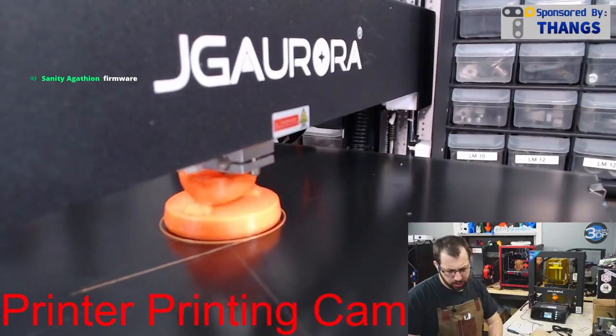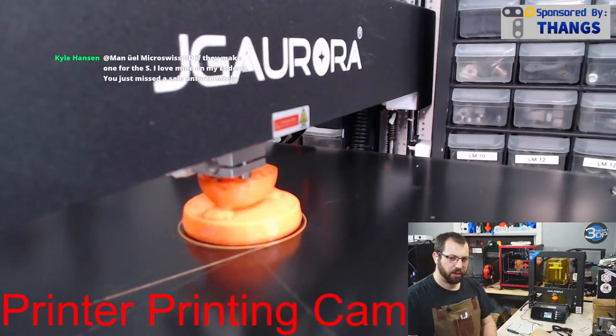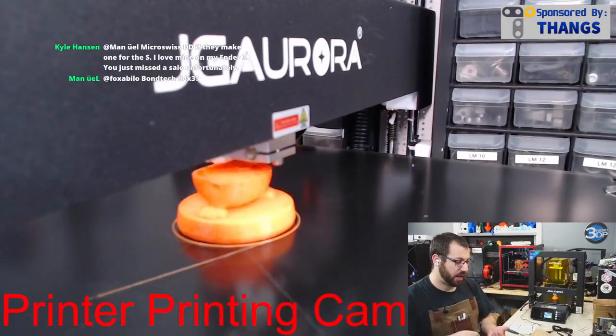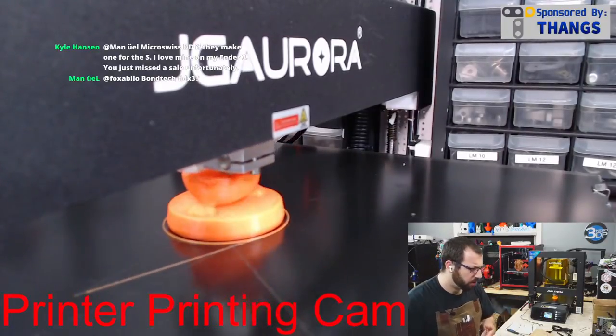Direct drive that prints BMG, any dual drive, you want an extruder that is dual drive and geared. So BMG, LGX, Orbiter, those are all good.